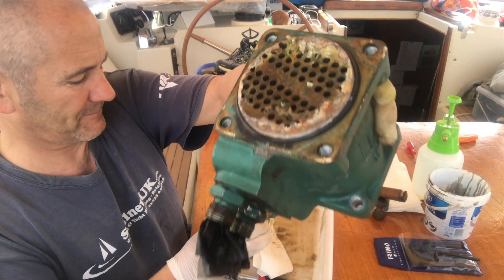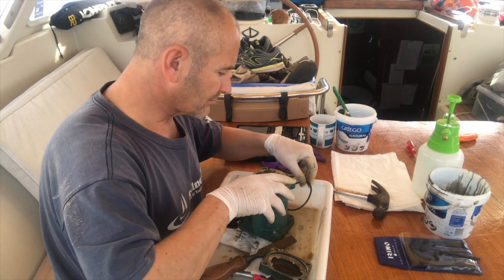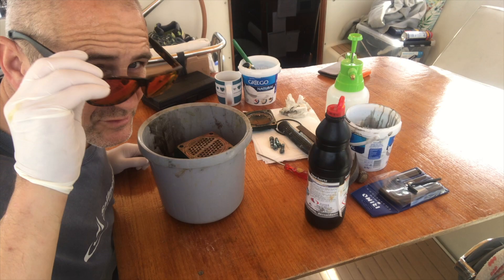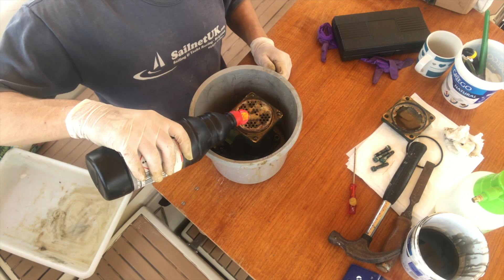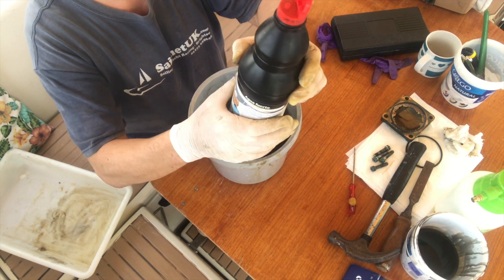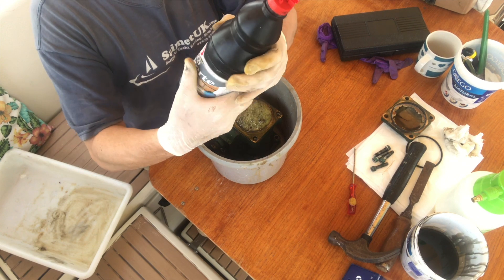Quite a build up there. About 10% of these are blocked so I'm going to give it a wash out with Aquafurta from both ends, and give it a poke through to clear all the ones that are blocked. In the absence of safety goggles I've got some fancy sunglasses. So it gets to work on it straight away — all the calcium deposits. Aquafurta is about 20% hydrochloric acid. It's a Spanish brand — basically it's just brick cleaner, you can get it at any DIY shop and that bottle just cost 1 euro.